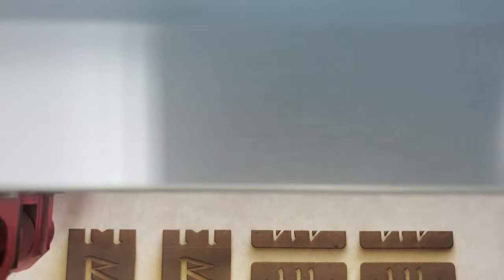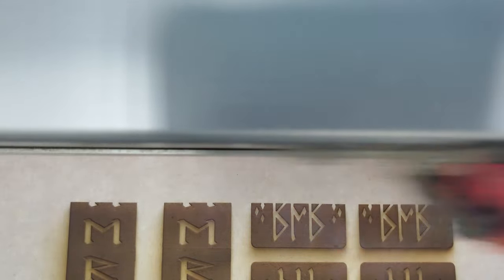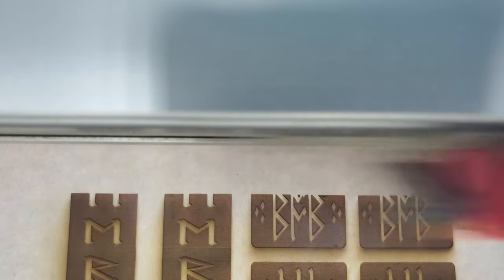All the engraved pieces that you see here were grouped together on the sheet. This has the benefit of allowing the laser to move the shortest distance with each pass, greatly increasing its speed. Having the pieces masked like this will also reveal a very clean, contrasting engraving later.